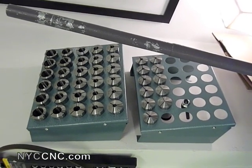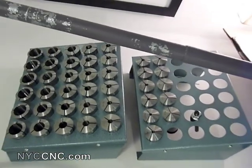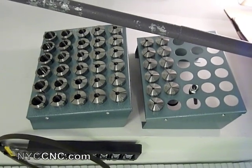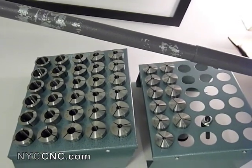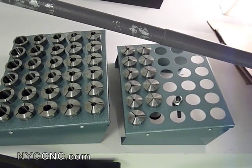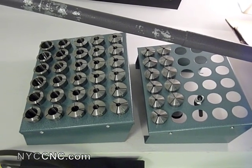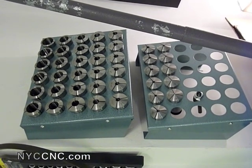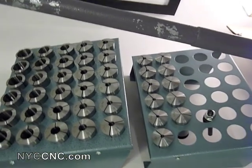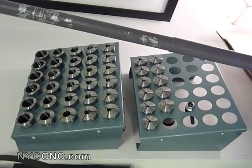The downside to 5C collets is that they have less of a gripping range, so you need to own more of them. I bought a 32-collet set, which I think is half of the amount available — I didn't buy the 64th intervals. But then I bought the 64ths around plus and minus 64th on common sizes like quarter, three-eighths, half, etc. I find that does the trick for me, since I'm often taking normally available round stock and turning it down a hair. If you're buying high-quality ones, they're much more expensive. I tend to buy the discount ones from ENCO, which are of import quality.